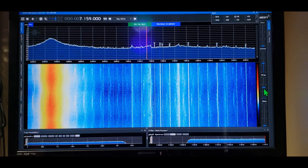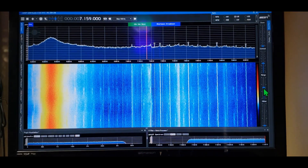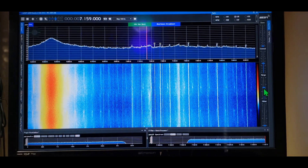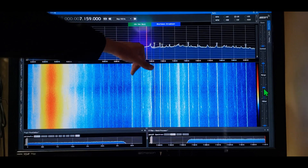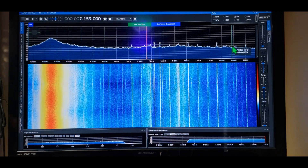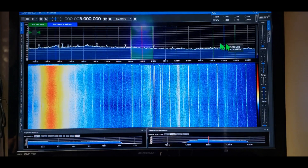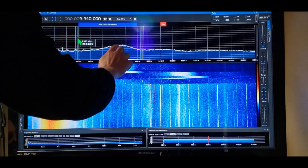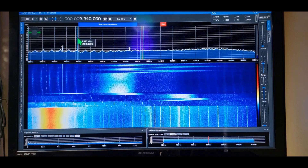You need to work on grounding — get your coax grounded, that's a telltale sign. That noise would help too once addressed. We know our capacitor stops around here, so let's find out where else it's resonant. Keep scrolling down the band... looky there — 30 meters! We've got a little bit of peak action here. Let's try turning the capacitor... yep, see it moving.